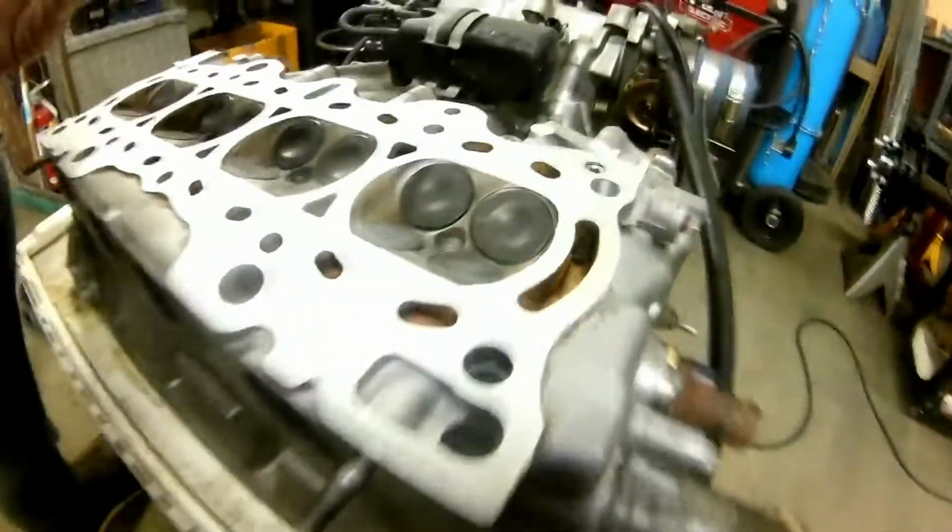Well, it came out better than I thought. Super excited about it. We went ahead and welded up. There's a little hole right there that's actually in the chamber. That's probably where it struck the arc, but I don't even care because that's nowhere near where the head gasket goes, and where our line is. The issues we had are no more.